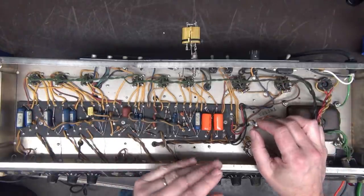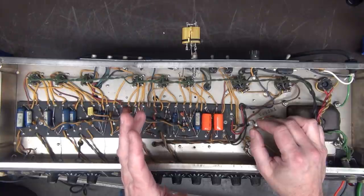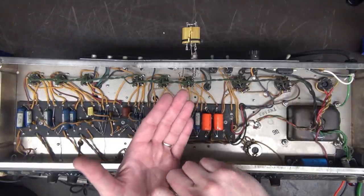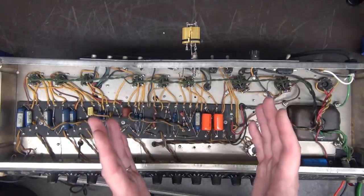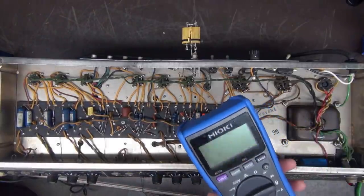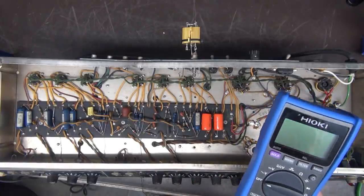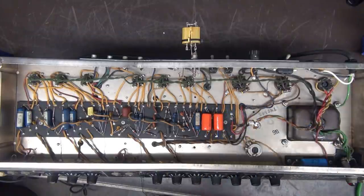And that's what happened. But ever since that day, I knew that an auto range meter could mess with you, okay? So I've always had ranging meters. If I want to measure 150 volts, I would put my ranging meter at 200. And if I saw 150, guess what? It's 150. So I've been reluctant to do this, but I have a future application where I'm going to need an auto range meter that you guys will see in some future videos. So this would just be a good opportunity to check it out.